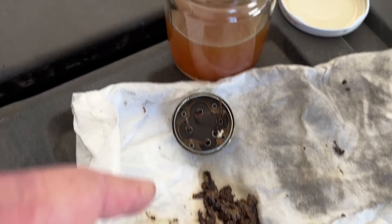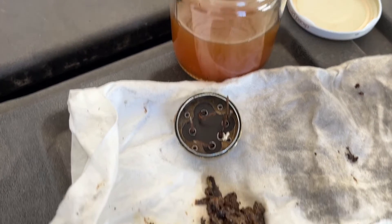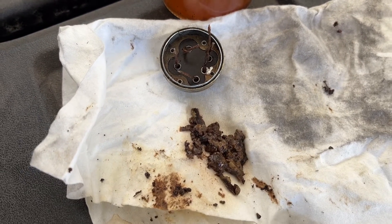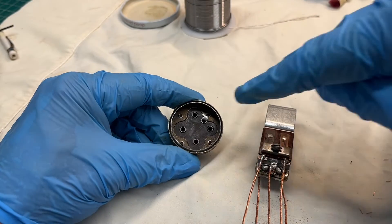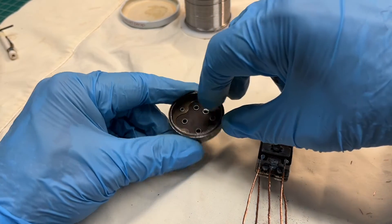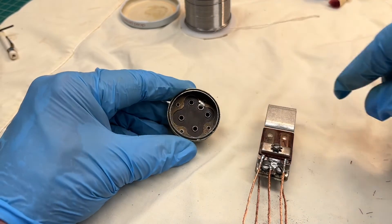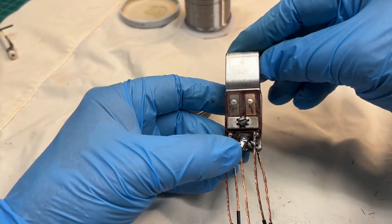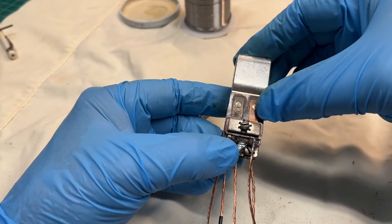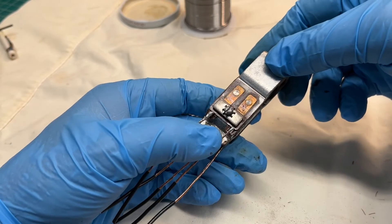Here's the remaining rubber after soaking the base of the synchronous vibrator in lacquer thinner for a few days, and as you can see, everything cleaned up really well. The vibrator there cleaned up as well. All new lead dress placed on, everything adjusted best I could, and the contacts cleaned.